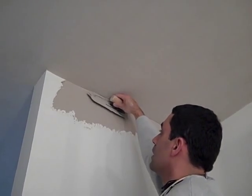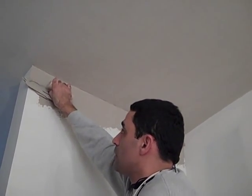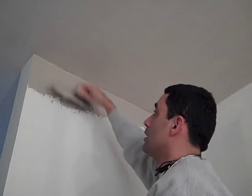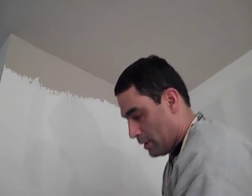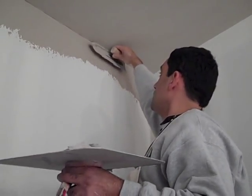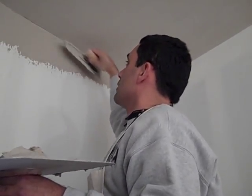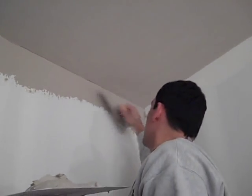Now again, this is going on as thick as a credit card, about, give or take. Now this isn't hard, so it's a little harder. Okay. And it will go on thicker. But basically that's what you want to do. And a way to test it is, I'll show you in a minute, put a credit card to it and do it. All right, now. What I'm going to do is go back where I put the other one on, where it's extra, and just take it off. Pull it off. Just trowel it down. Kind of play with it. And you'll see now that it's pretty much flat.